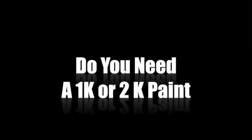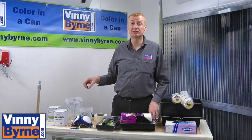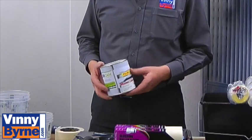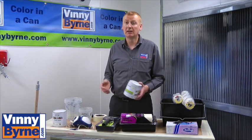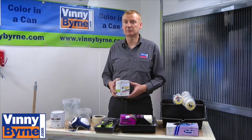The different types of floor paints — we have 1Ks and 2Ks. We'll start off with the easiest paint, which is what we call a single pack paint, sometimes referred to as a 1K paint. Basically very easy to use, it's designed for light traffic — so areas like where there'll be just foot traffic, or maybe a garden shed where there's just lawnmowers, ladders, that type of stuff.